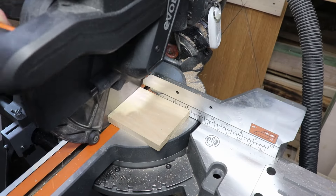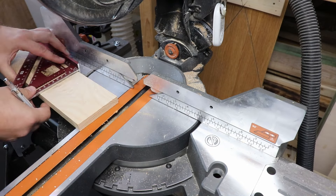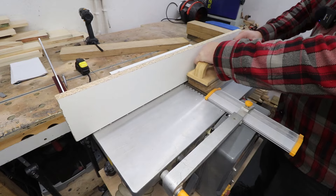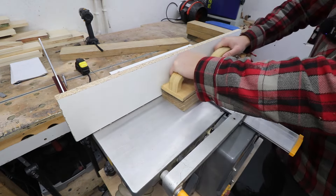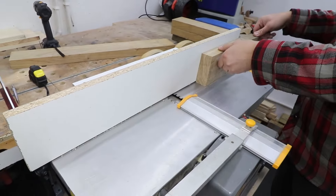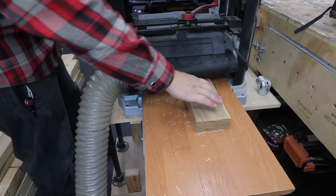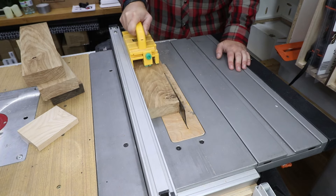To make it even more interesting I will be adding a top and bottom to this slab from white ash — hopefully this color combination will be quite interesting. Then it's time for the jointer to make sure one of the faces and the sides are nice, flat and true. And finally with the table saw we can cut these pieces to the correct width.